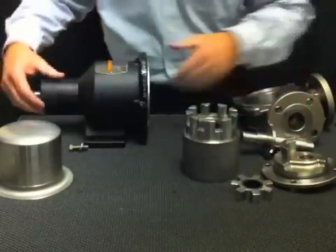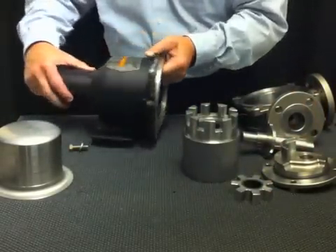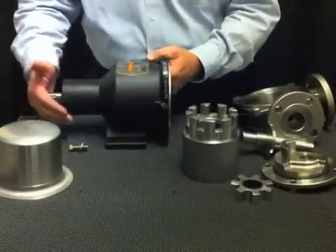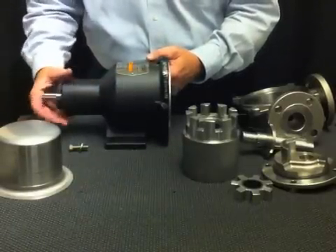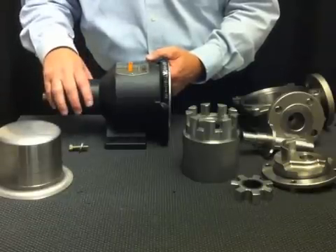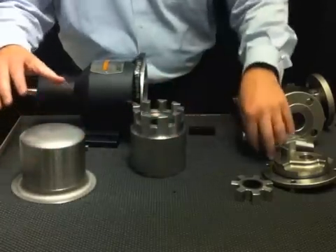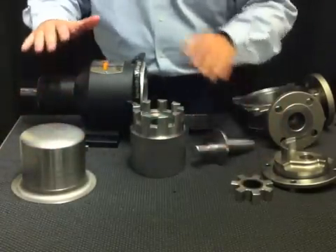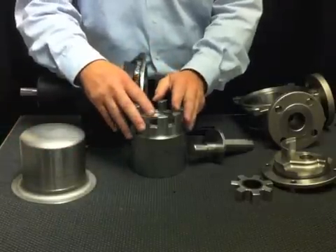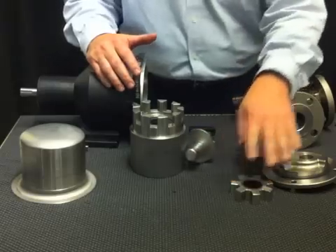The last component of the pump is the outer mag drive housing. There is an outer set of magnets supported by two greased and sealed-for-life bearings connected to the drive shaft. The drive shaft can then be connected to a gearbox or a motor. We also make C-face adapters which allow you to close-couple motors or gearboxes directly to the pump. You can see here that simple design based around seven primary components: outer mag drive assembly, containment can, rotor assembly, the casing, the eccentric spindle, the idler gear, and the head.